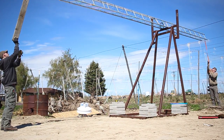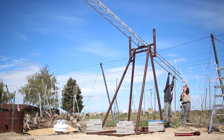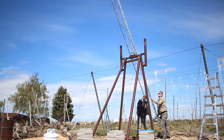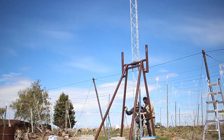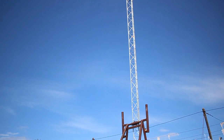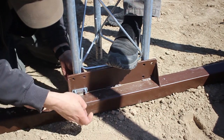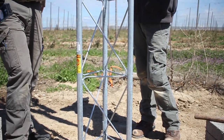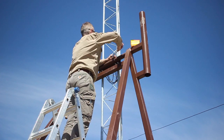The process is both safe and easy for a two-man ground crew thanks to the innovative pivoting design. The base of the tower is then secured to the fastening plate at the bottom. Final adjustments and tightening of all the U-bolts is then performed.